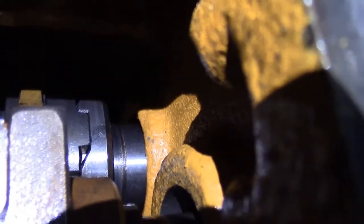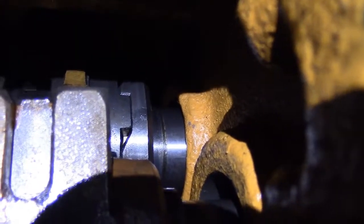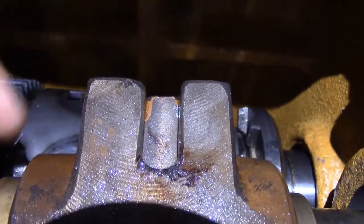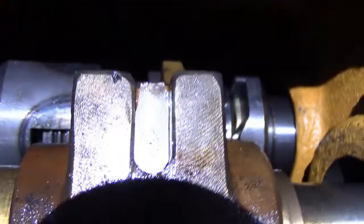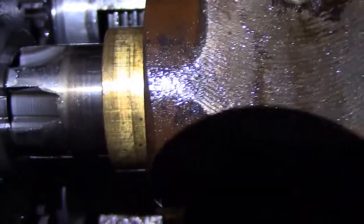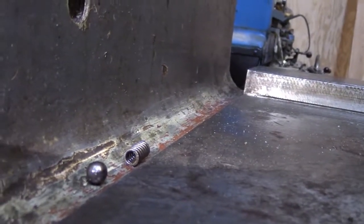That would be my standard traverse. You could set for whatever speed you wanted. The rapid traverse is pulling this lever the opposite direction. So I'd move it this way, I'd pull it this way, and that turns it into rapid traverse, but I can't engage it without turning these gears. But anyway, that's what it does. And so my conundrum, where in the world did those come from? Well, I found out, silly me, and that's why it's not working.